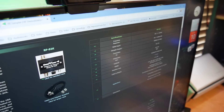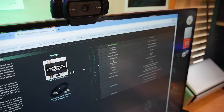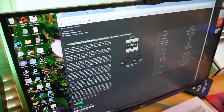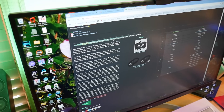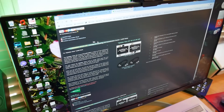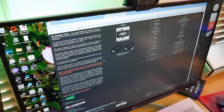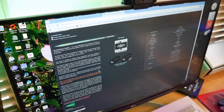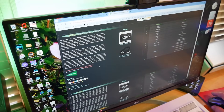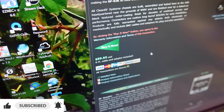The sampler output is minus 60 dBm at 15 megahertz. Rated input up to 2000 watts PEP. And the frequency response up to 30 megahertz — note I was using it on UHF, but it still works very, very well. There is another RF sampler that goes up to four kilowatts. And then there is a variable RF demodulator, another RF demodulator, a variable RF sampler and RF demodulator combo, a modulation monitor, and so on. The one I am using is the 2K one, which is $89.95 or about $90 plus tax plus shipping — will run you a little over $100. You can pay including using PayPal if you want to.